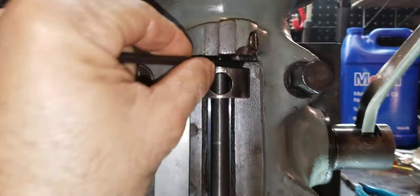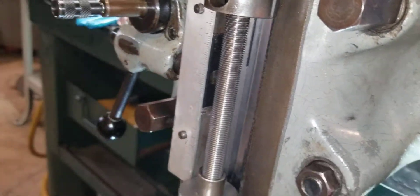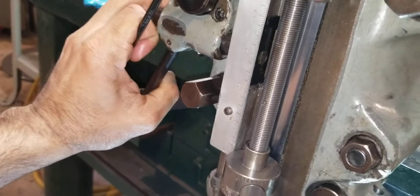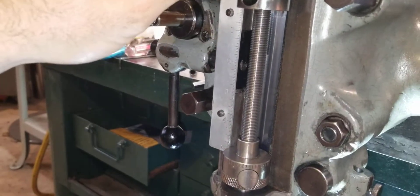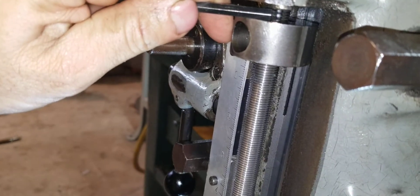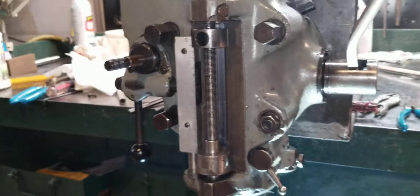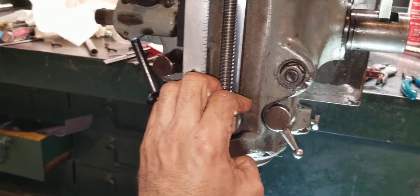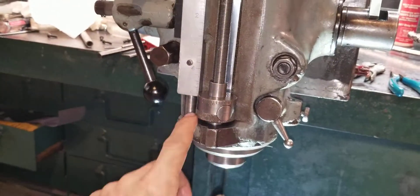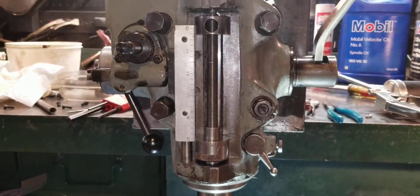I'm not going to fool with it anymore — I'm going to leave it right there. Watch how much that thing moves. Let's see if I can get the handle and this in the same frame. That's just gravity taking the handle down. Push — so that ought to do it. Now we can check the down direction too. You hardly have to push on that thing for it to disconnect, so that actually adjusts both of them, making both of them more of a hair trigger. So there you go — that's how you adjust that. Good luck.